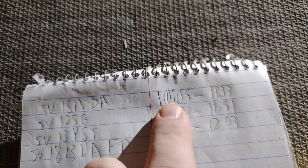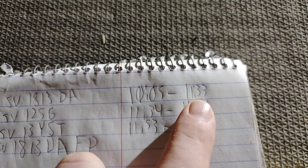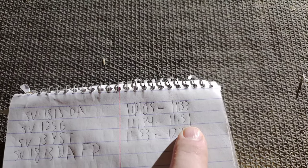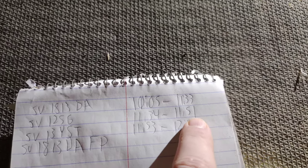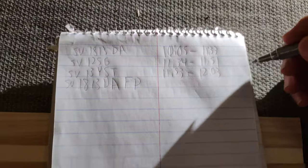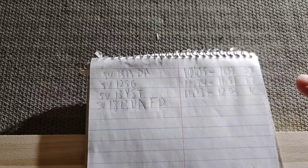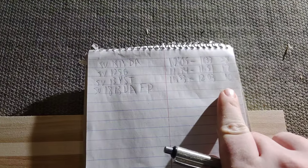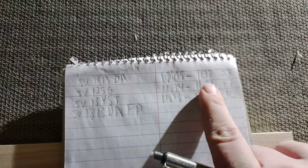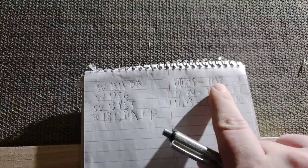I wrote 10 for some reason even though it was 11:05. The cordless took 28 minutes, the quarter sheet took 17 minutes, and the corded took 10 minutes. There's a caveat with the quarter sheet — I'm going to do another run with fresh paper, because there's no way a corded quarter sheet should take less time than even a cordless 5-inch. The quarter sheet actually doesn't take much longer than the corded 5-inch and took less time than the cordless, but like I said, there's a caveat.